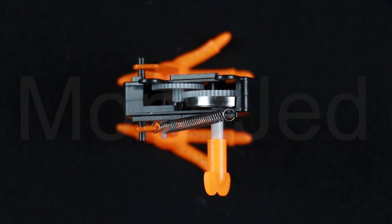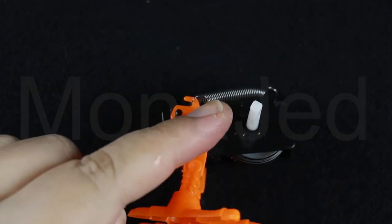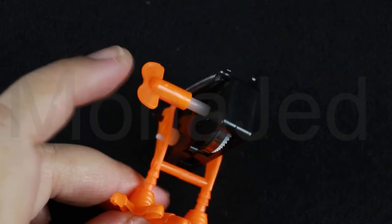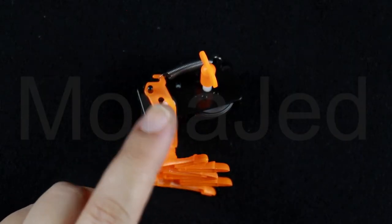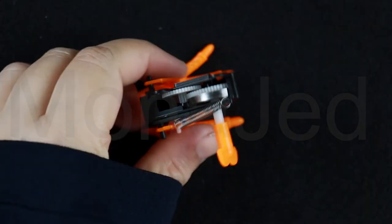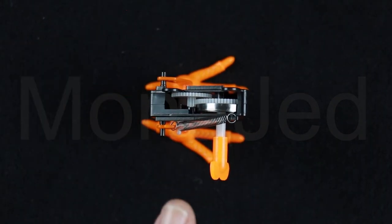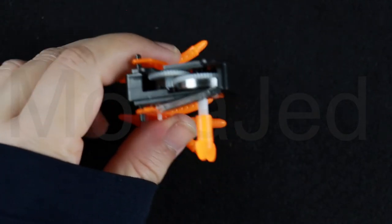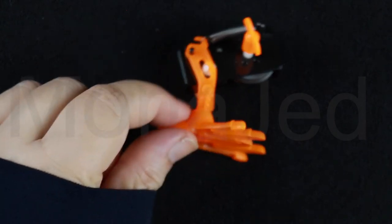What we've got here is a Geneva drive that makes the legs hop intermittently. Here's how it works. You wind up the white plastic crown — in this case, it's attached to this key. The main spring inside the black case is the one that stores up all the energy. You can see it peeking around here at the bottom and on top. You can also see the gears inside this black case. They take the power from the spring and drive the single crank on the outside of the case at a fairly low speed. The crank is this piece attached to the leg.